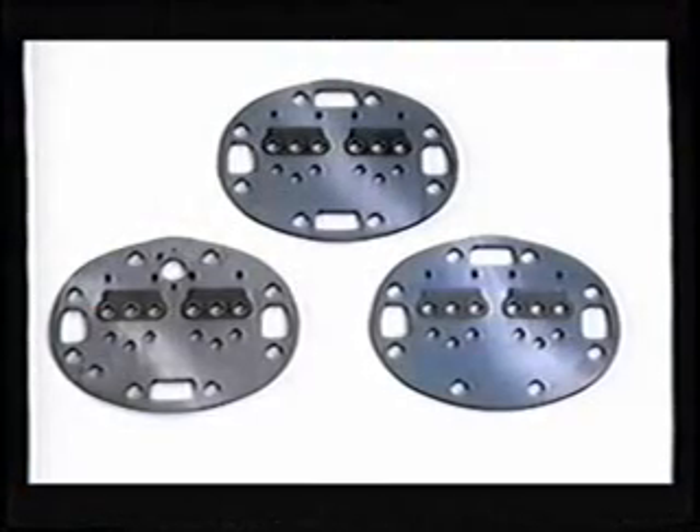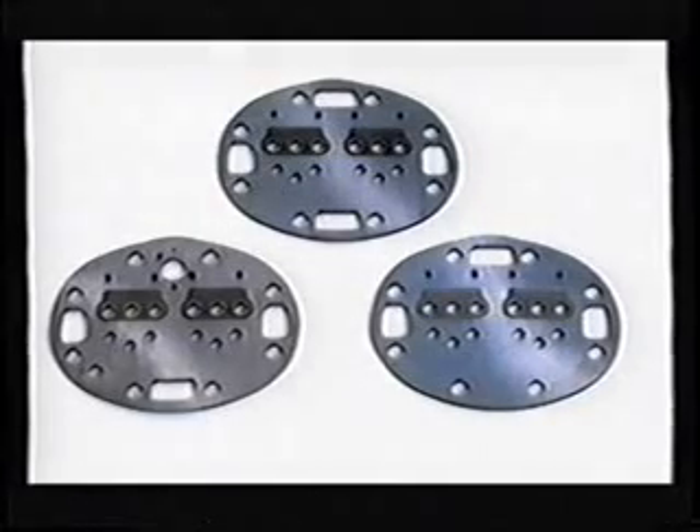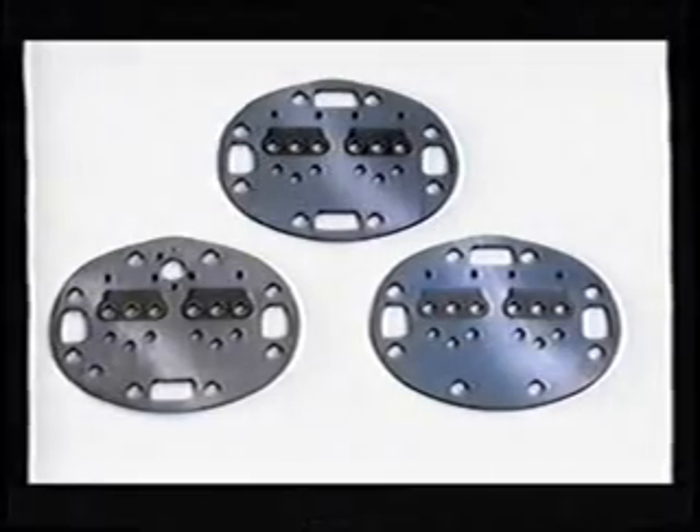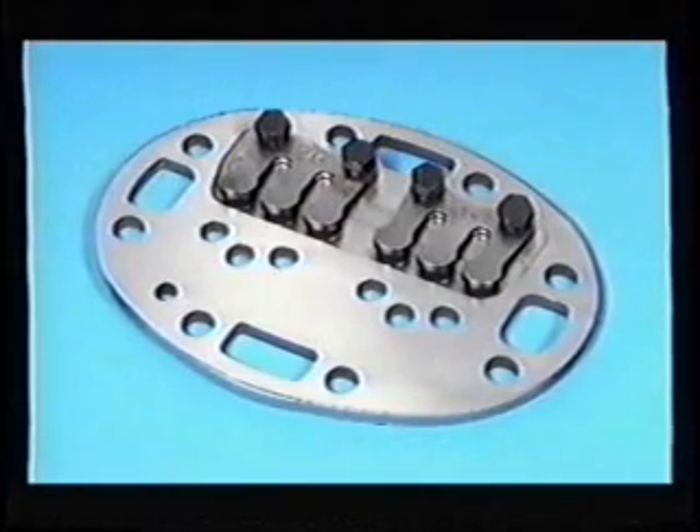Let's look at the valve plates on 06-D air conditioning duty compressors. All air conditioning valve plates have three discharge ports per cylinder. In the lower left, a valve plate designed for use with cylinder bypass unloading heads is used on side banks. Although not shown here, these valve plates come assembled with a check valve, which is fitted in the larger diameter opening at the upper center portion of the valve plate. Valve plates with only one suction inlet are used on some four-cylinder models. Refrigerant duty 06-DR compressors use a canted valve plate. It's used on the high-efficiency models and where additional capacity is desirable. Notice the indentation machined into the plate under the discharge valves and valve stops. This results in the discharge valves sitting closer to the cylinder bore, thus reducing the clearance volume between the top of the piston at top dead center and the valves themselves. By doing so, the rated compressor capacity increases.